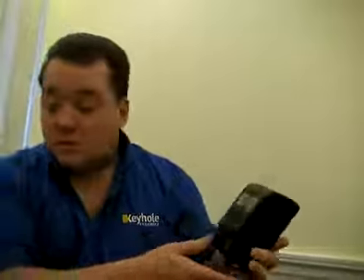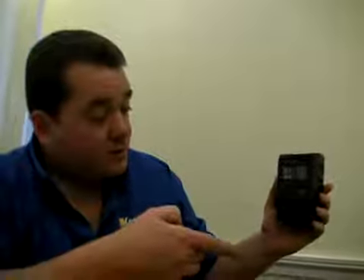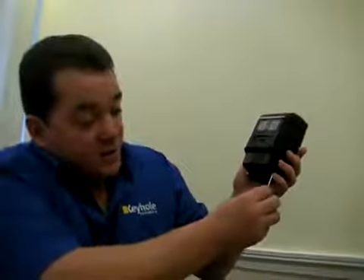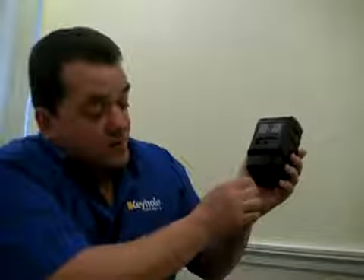Now I am going to remove this SD card, insert the SD card back into the camera, and turn the power on again. The LED light once again starts its sequence to load up the new settings file and has indicated it is ready with the green light. So if you now press the red button, the camera is now ready to install. I'll just do up these allen screws, which will keep the integrity of the IP65 seal.